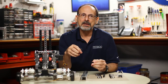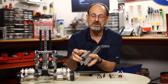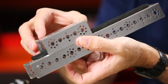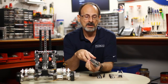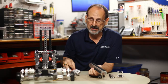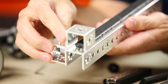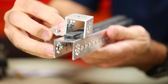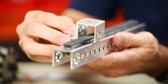The other thing that can impact performance is proper support. When we normally use a rack, some people only use one, and you can see that when you have a piece of channel on top of a single rack, because you need a certain amount of tolerance between the two for it to move back and forth, there can be a little play. One thing you can do is support it in two different planes. I'm showing that here — I've got the rack on two different sides of the same piece of channel, and I can create a secondary carriage with slide bearings on two different planes. As I move forward that stabilizes the carriage and gives me a very secure structure.